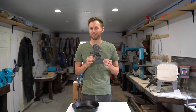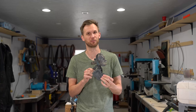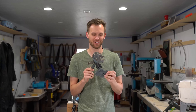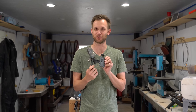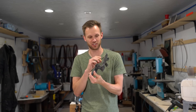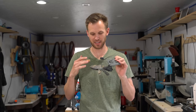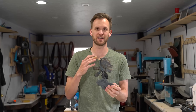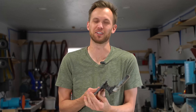That was not a perfect cast of even a small cast iron frying pan, but we do have part of one. I think I have enough that it's going to be worth cleaning it up and getting it into frying pan condition to see if I can actually cook something on it. So I got to cut off all these extra casting bits — the flashing, the sprues, the pour spout, all of that — and then I'm going to try and sand it and clean it up. I'm only missing two thirds of the pan, it's fine. How much of a frying pan do you really use at a time anyway?